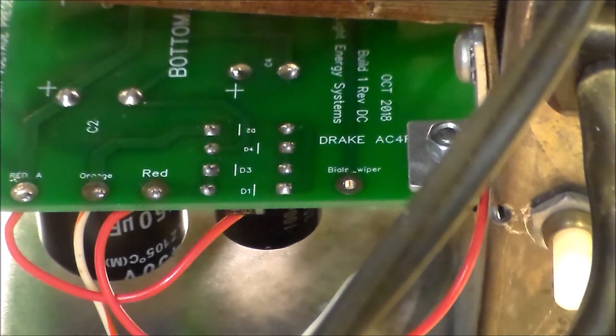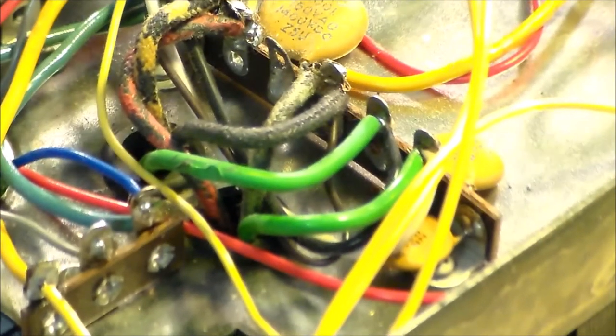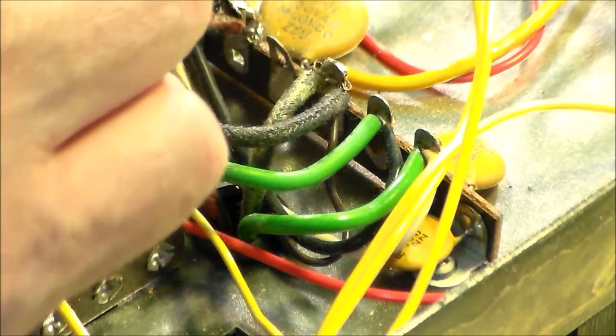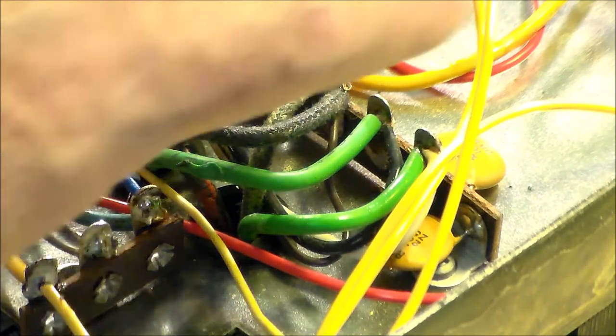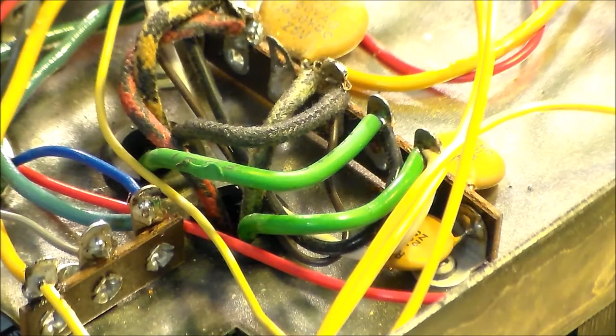Install the small yellow wire from the radio harness on lug number 3 of the new terminal strip. So, back here, wrong side. They believe that this is the wire they're referring to. Let's read that again. Install the small yellow wire from the radio harness. This is the harness, on lug number 3 of the new terminal strip. So if this is 1 and that's ground, that's 3. And is that the same as what I've got over here? Yes.